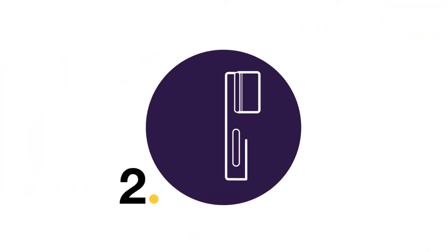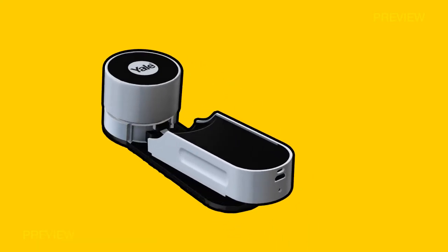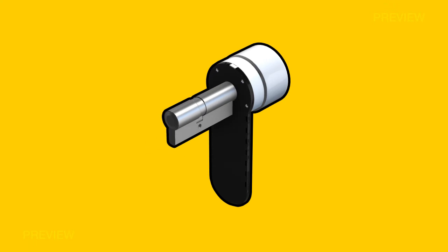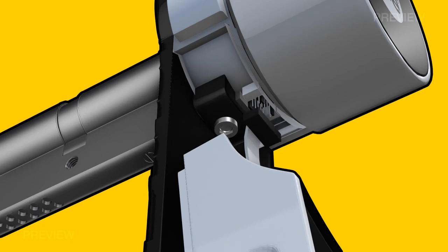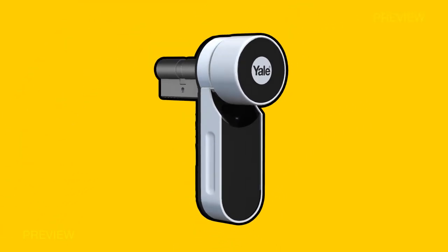Step 2: Aligning the cylinder with the unit. Remove the current cylinder from the door. If your kit comes without a cylinder, disassemble the unit and disconnect the data cable. Rotate the knob to the zero position and insert the cylinder. Verify that the cylinder is aligned with the knob's rectangle bore, then insert and tighten the cylinder's mounting screw. Connect the data cable plug and reassemble the unit. Enter units are also available with a pre-fitted cylinder.